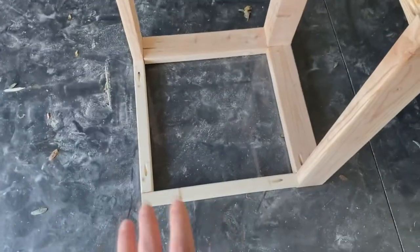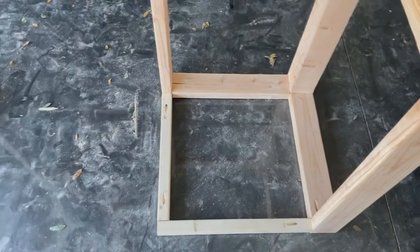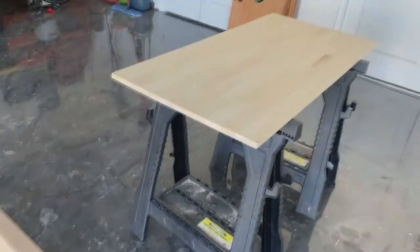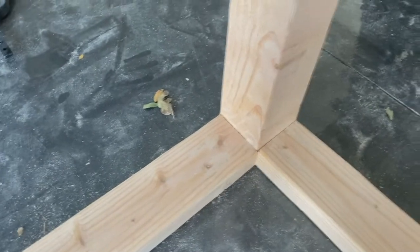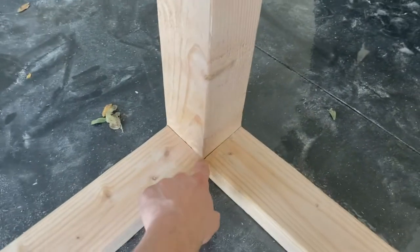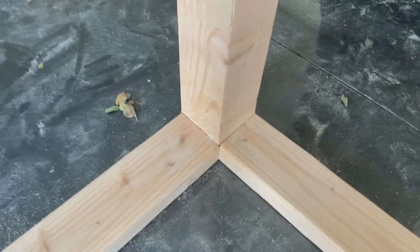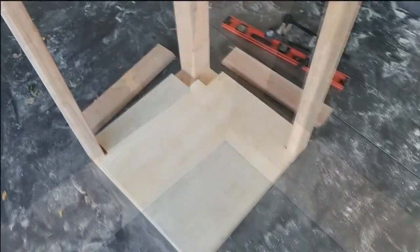These aren't exactly square, definitely not as square as I'd like them. So I'm gonna take individual measurements for each side and then transfer them over to the board, and hopefully it lines up pretty well. And then I gotta cut these bad boys out so that it fits in there pretty nice. And I'm gonna have to go a little bit, maybe an inch, maybe an inch and a half, out from the 4x4 here, which is the reason I had to put wood filler in there, because otherwise that slat that comes up at an angle rests right in there, and so my flat table won't be able to sit right there. So I'll show you what I mean once I do it.